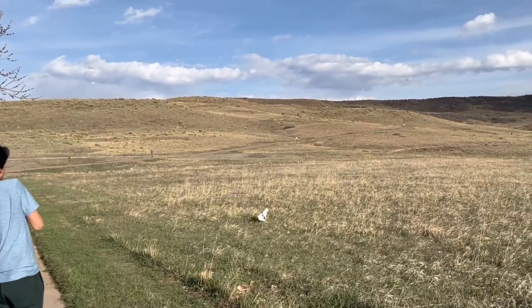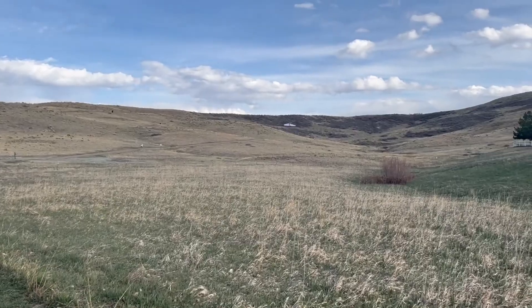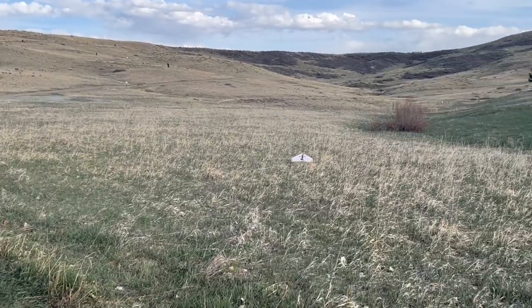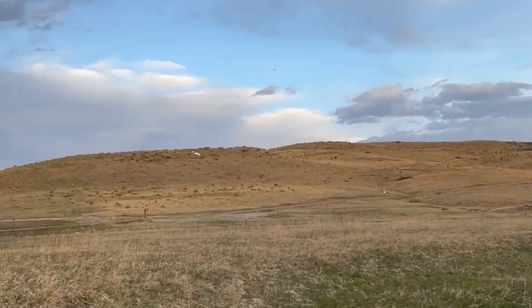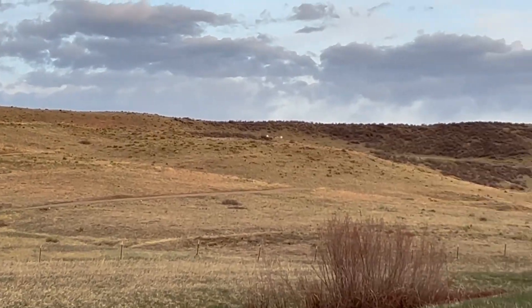This was the first finished iteration of the new design. The wing had some very bizarre flight characteristics — there were points where it was actually fine, but it felt extremely tail heavy, and some points where it would just constantly dive into the ground. To get a chance to control it I threw it from higher up, and this time it actually started flying — not well by any means, just kept swaying side to side since it was too tail heavy.